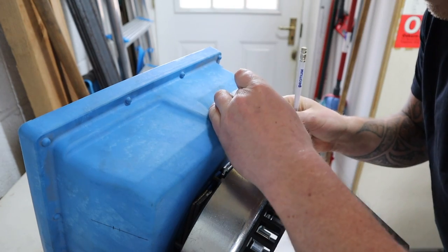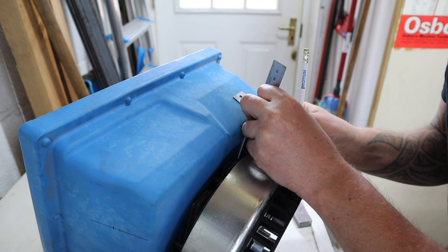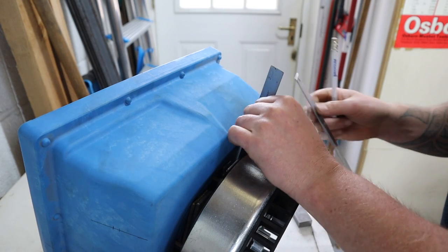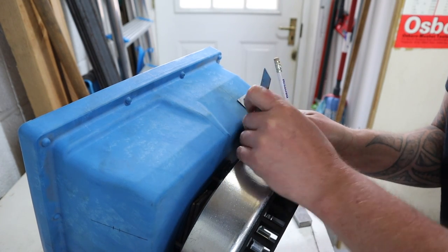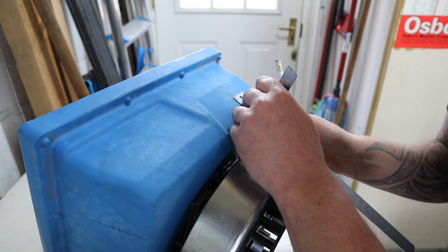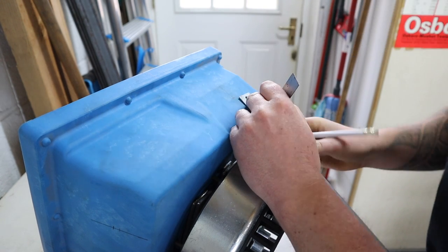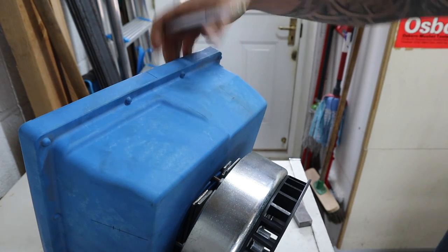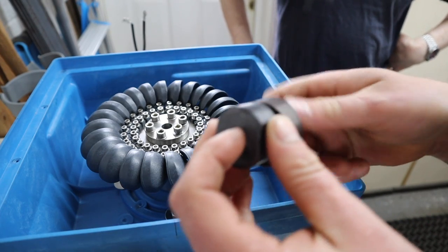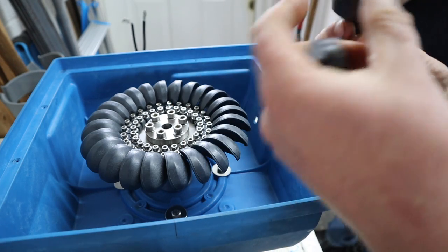Hang on, that's 45mm. A little mark goes there and that's our point that we're going to cut out with the punch. The nozzle will go through there — we're going to use one of these Q-Max cutters again. Very nice little thing for cutting these plastics and sheet metal too — great little tool.